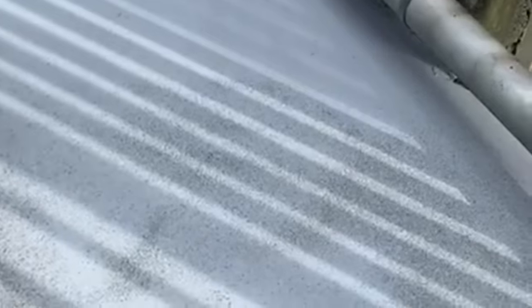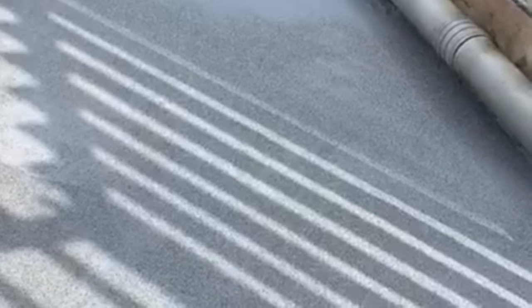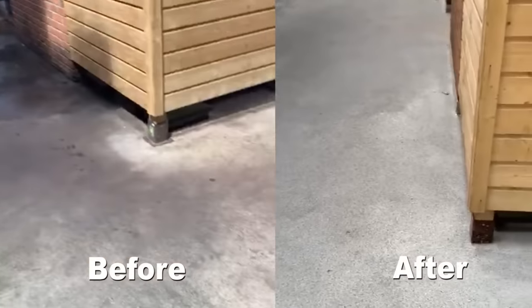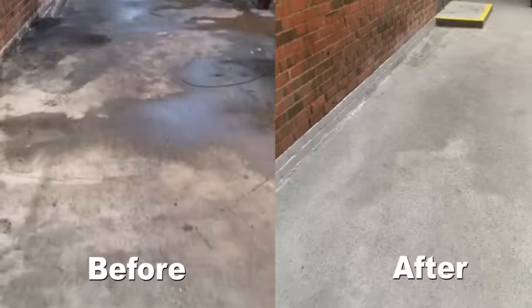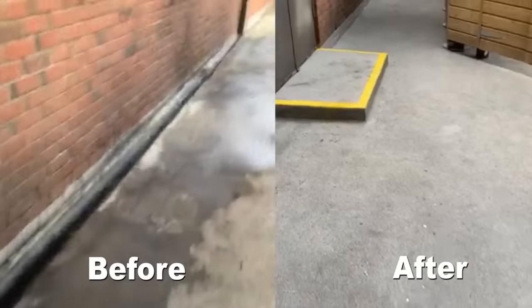Apply your quartz, then brush or hoover off any excess, and then apply another layer of clear top coat to seal the system and complete it. This system can be used on roofs, terraces, balconies, auto decks and more. As you can see, the quartz has been applied liberally, and another layer of clear top coat will then be applied to complete the system. Here is a beautiful before and after of this project — it is waterproof, anti-slip, and the colors have been matched back in simply by changing the color quartz and using it with the clear top coat.